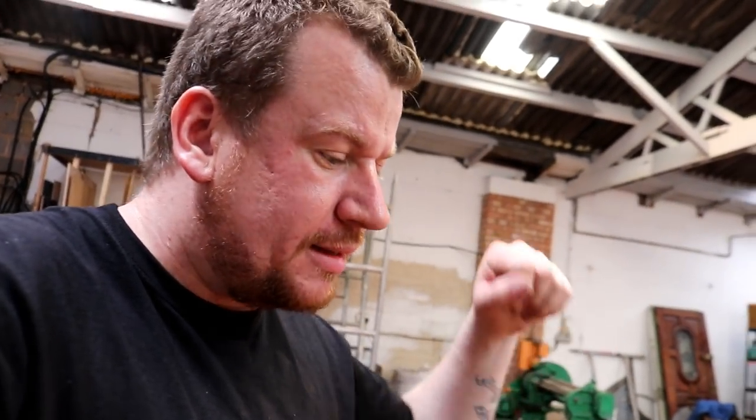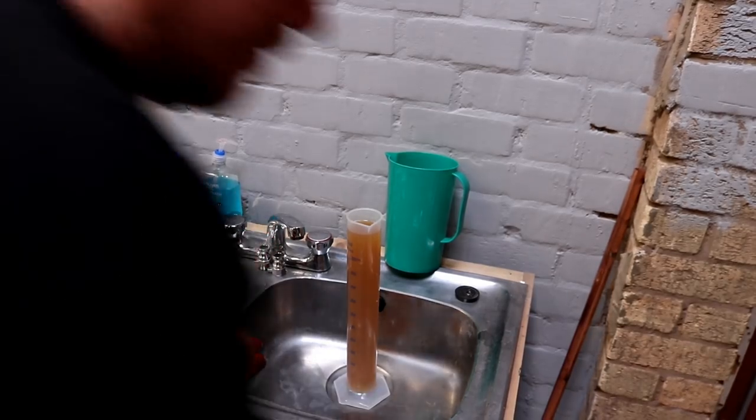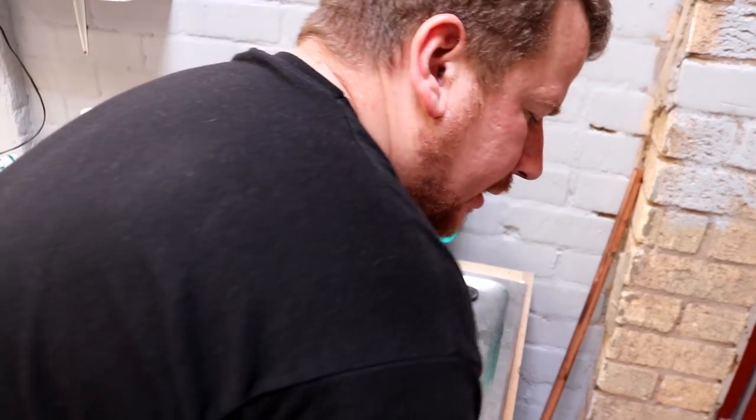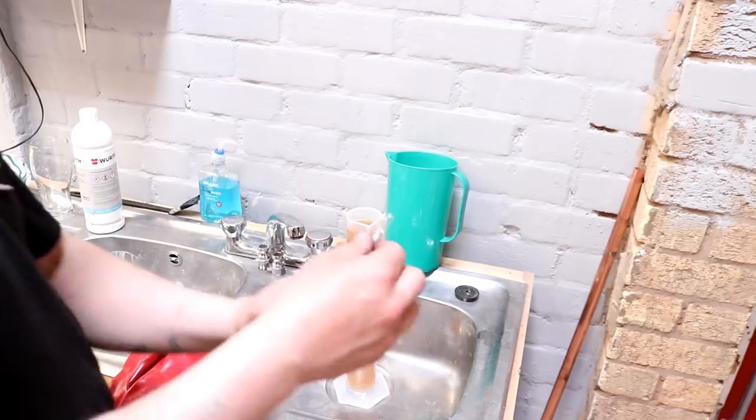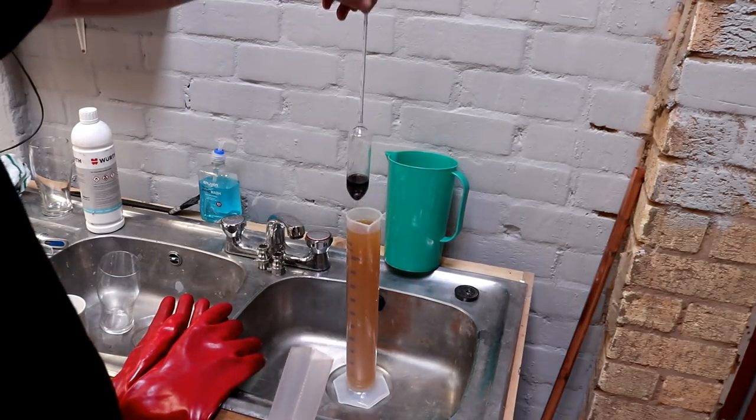Right, I'm going to go up top now with the hose pipe connected to the CLT and the pump, so I've got more power than the mains, and I'm going to blast off most of the gunk, and then we'll put that caustic in the tank when it's clean and recirculate it to CIP the whole thing. Good idea.